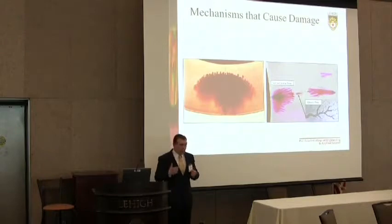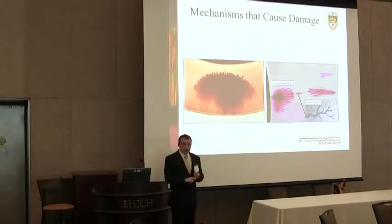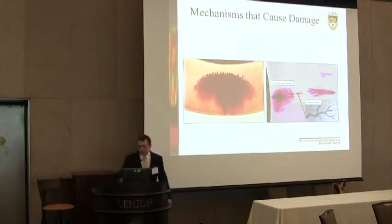The way we can fix these cables is to replace them, but replacement is extremely capital intensive — we have to shift loads to other lines and dig up and replace the cable. Or you can rejuvenate them, and this is the main motivating factor for cable rejuvenation.